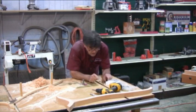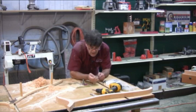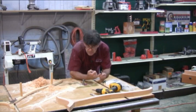But here's another trick. A lot of guys don't even realize that you can change bearings on router bits. I'm a firm believer in my little cliche of sneak up on it. It just works, guys. It just flat works. Ease into your cuts. Don't get so aggressive. Now, in the case of the half-inch spiral, I could have put on a 9/16 bearing, which would have made me cut a 16th of an inch larger instead of being a pure flush. Do the same thing with this bit.